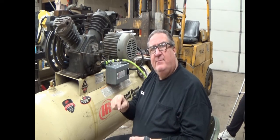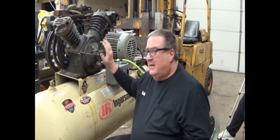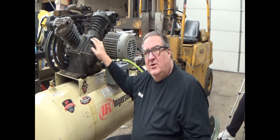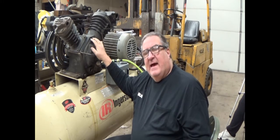Because you've got your compression and then you've got your explosion stroke in your four-stroke engine, little tiny pieces of carbon blow past the rings and turn your engine oil black. However, in a compressor the oil does wear out, but it never looks dirty. This oil looked dirty — I have no idea what they were putting in it. The oil was filthy, and we don't want to just put clean oil in it and send it back out.